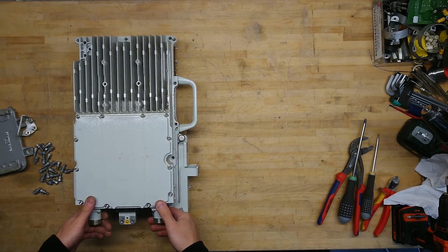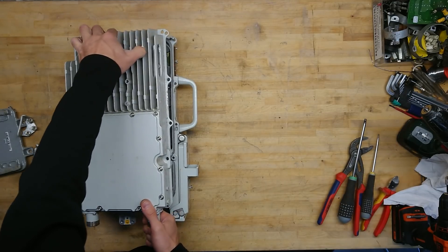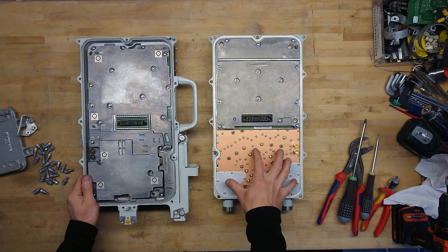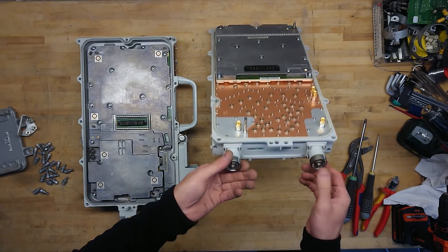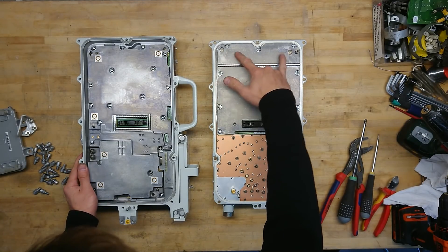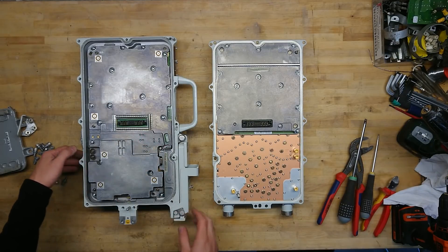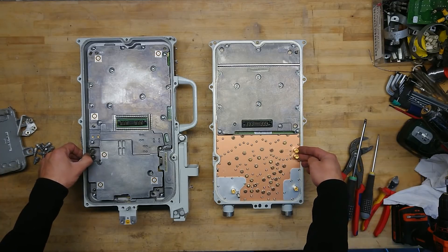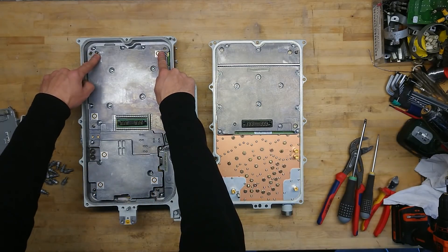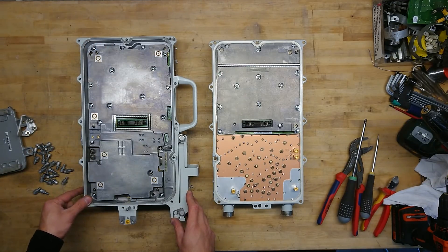We can see the duplexer up here, as we have these big antenna connectors. There's a box here and all of this surrounding area is just heat sink. As expected we have the duplexer here. This up here looks to be the power amplifier, because we can see there is a huge heat sink base plate around the bottom. There are connectors labeled Transmit A, Transmit B, Forward A, Forward B, and on this side RXB and RXA — so the receiving connectors sit here. There are some feedback connectors at the bottom, and the two transmit outputs from the system unit or digital-to-analog converter.